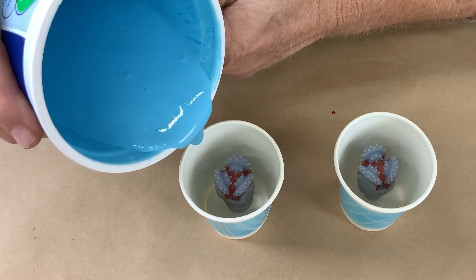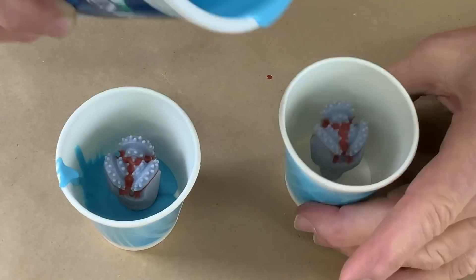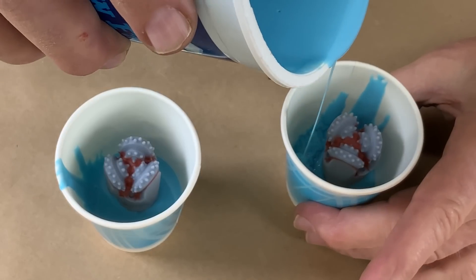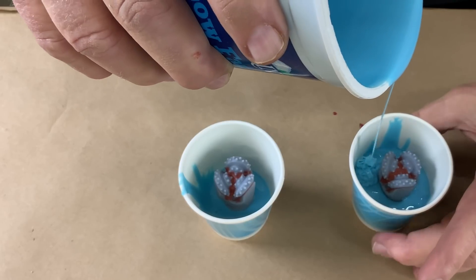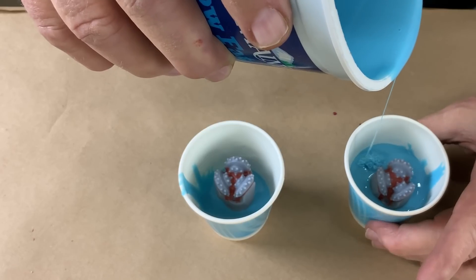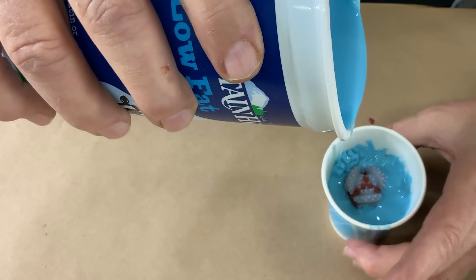I guesstimated by eyeball how much rubber to mix up and got it all vacuumed and nicely de-aired. No sprues, no vents, nothing — just straight pours. As always, I'm going to pour from the bottom. I'm especially worried about those threads; I don't want to trap air in those fine threads, so I'm going to pour from the bottom and go slow. I'll pour a little faster once I get past the threads. Right about at this level there are these three holes, and I want to make sure I watch the rubber fall into those holes — I don't want to drape those holes, that's just a classic place to catch a bubble. Even here at the top I'm just letting the rubber flow around — don't want to drape those teeth. Let the rubber flow around from the bottom up. That's how you pour a mold.